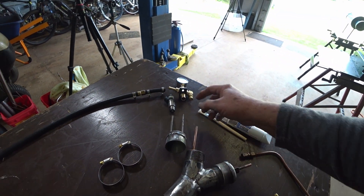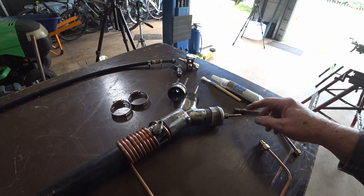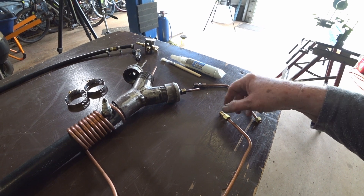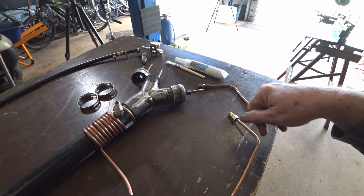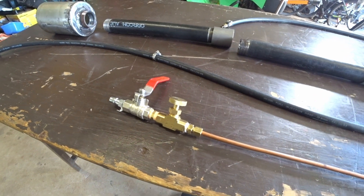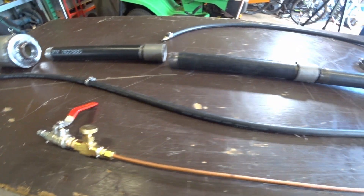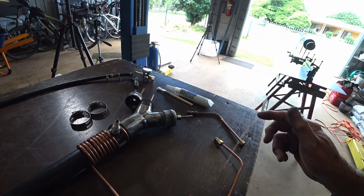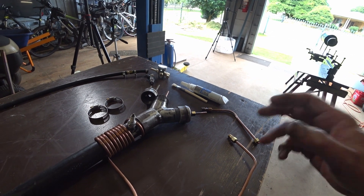On this side all we have is the air inlet with a bit of a swirl setup inside, and it will have copper down to the back. It has a tap to turn the air on and off and a needle valve to adjust the amount of air. The amount of air will be dictating whether the fuel mix is right, and we'll also be purging between strokes.